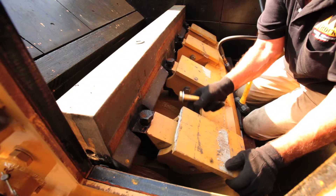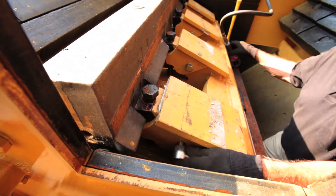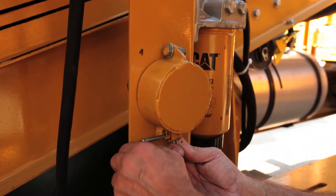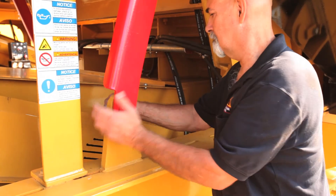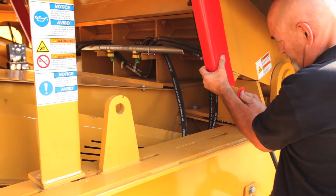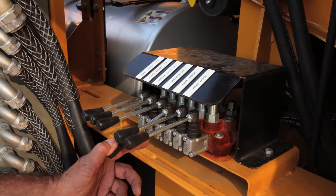Reinstall the rotor shoes. Turn the master switch on. Remove the crusher lid safety bars. Start the Caterpillar engine. By using the hydraulic control lever, close the crusher lid.